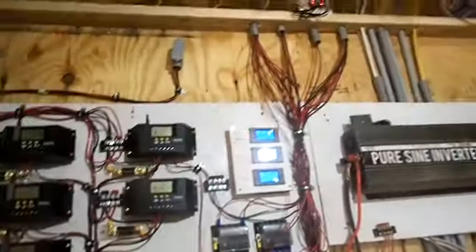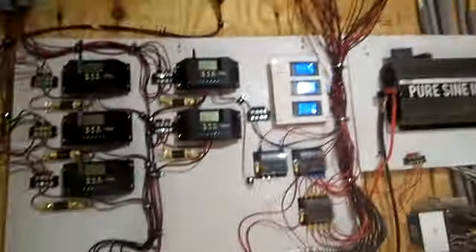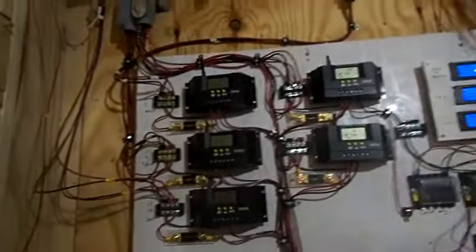Sue's cooking coffee. On our little amp meter we're using 5.47 amps. And back here — let's turn the light on — it's using 70 amps. So where our loss is, is in the inverter. That's why I wanted to go 12 volts for everything, because we'd use a lot less current. These batteries — we wouldn't even have to have as many batteries as what we've got for solar panels.